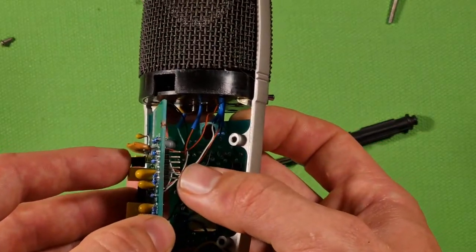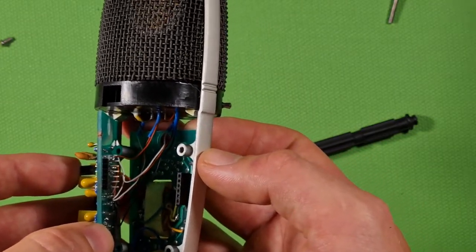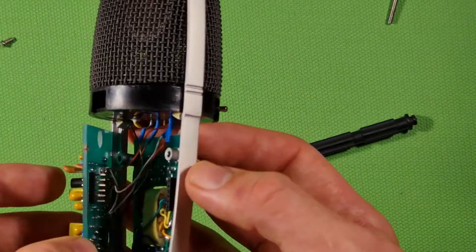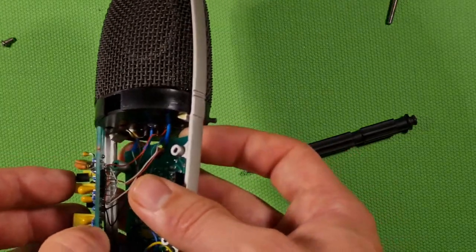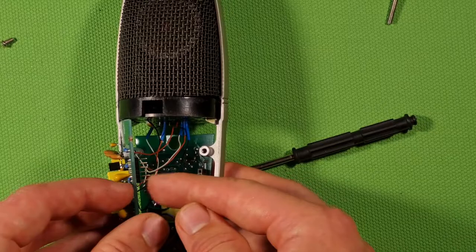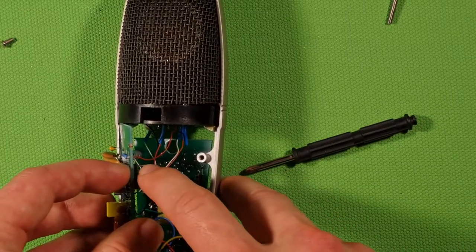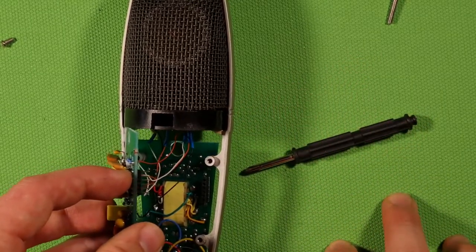No, actually, I first took some isopropyl alcohol and cleaned them with a Q-tip. But that didn't seem to do anything. So the corrosion was very big. So actually, I took my multimeter and tested between the points between the jumper cables, where they had been soldered. And I found out that the surface of it had no connection at all.